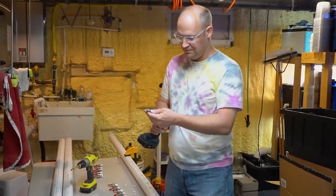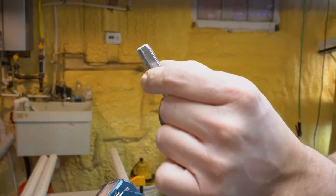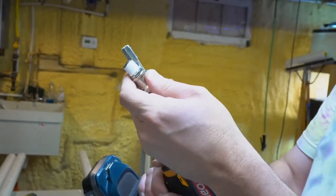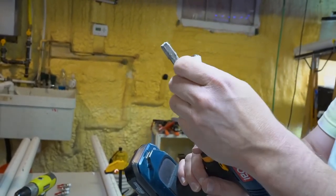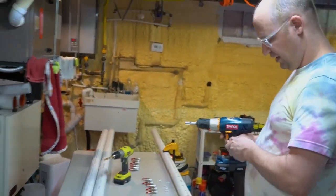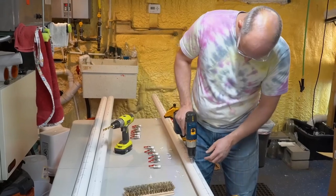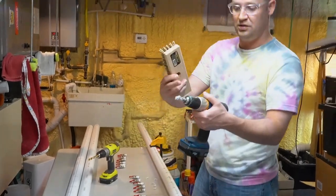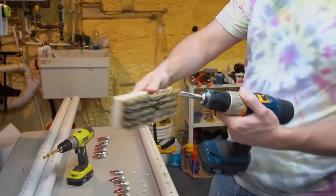The trick with these is you don't want to go all the way to the end because the threader is tapered — skinnier at the front and wider at the back. You want to go about three quarters of the way so there's still plenty of tightness when the valve screws in. Going all the way would leave it a little looser in the hole, and we don't want that. Go in nice and slow and straight, then stop and reverse it. After each hole, clean all the gunk off the threader so you get nice clean threads every time.